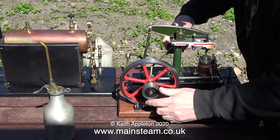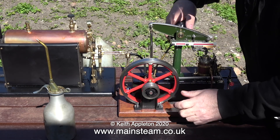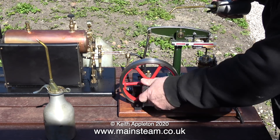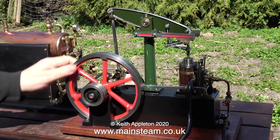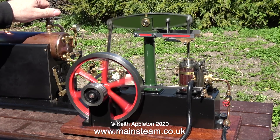While I've been messing about with the lubricator, the boiler is in steam. All I need to do now is just oil around the engine — the golden rule being: if it moves, oil it. In no time at all there was a small amount of pressure on the clock, because these old Stuart 504 boilers are really good at raising steam. All I have to do is rotate the flywheel to clear all the condensed water that's inside the cylinder.